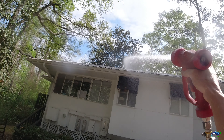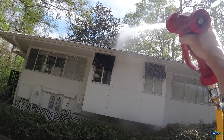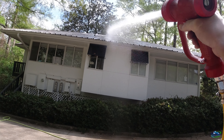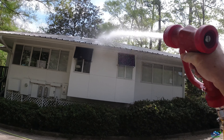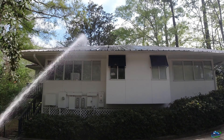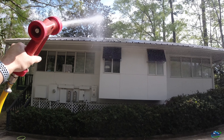Hitting the peak, no problems. It's a little warm day — supposed to get into the 80s today. The solid debris is just rolling off. They did put gutter guards on here but unfortunately they chose the wrong ones — the big screen gutter guard. It actually holds more stuff than it blocks. We've got a lot of pine needles around here so the big screen does no justice honestly, but somebody sold them that.